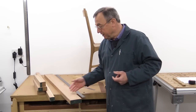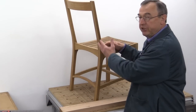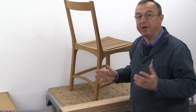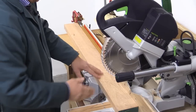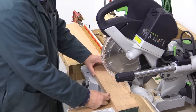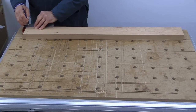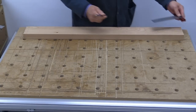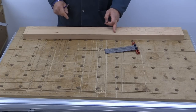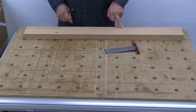But I can still give it a little bit of character. Now the previous chair was one of several, so when I made it I made up a pattern and used it to create multiple versions of the rear section. But as we're just making one chair I'm going to use a different technique. What I'm doing is cutting this piece of wood 40 millimeters longer than it needs to be. I'm just marking where we would want to cut it when all this work is done — so that's 20 millimeters from each end. Now the next thing I need to do from the plan is to mark the centre line where the domino joint will be, which keeps the leg attached to the side rails.